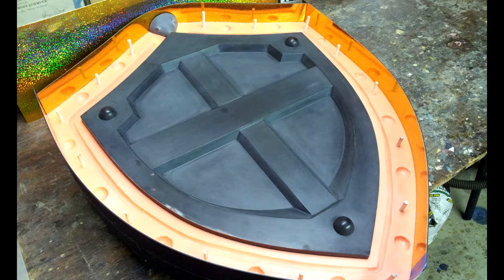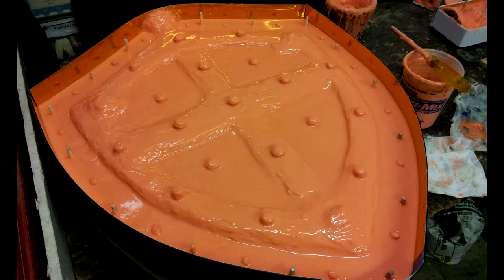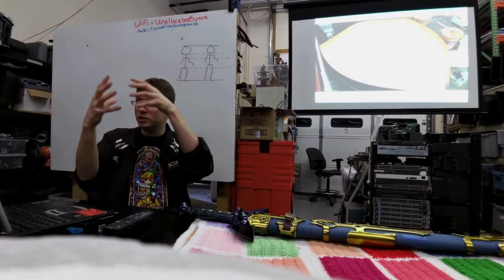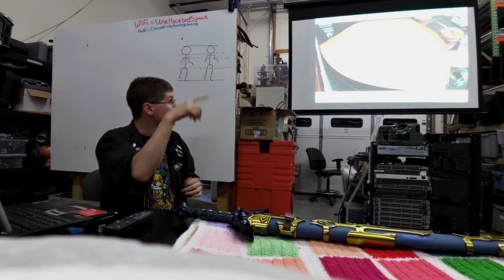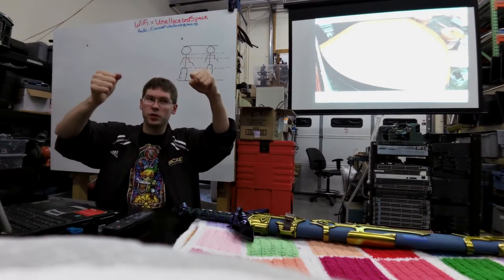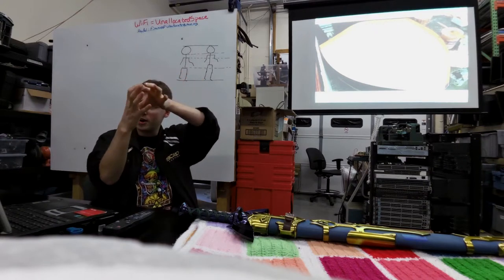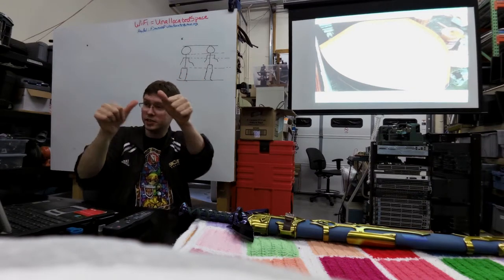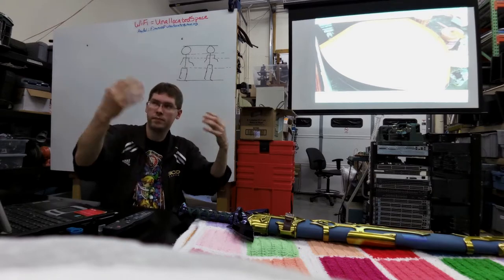This half now has dents where all those keys and running gaskets were, and the bolts or pegs are still sitting in there — I just split them off the other direction so I can pour more rubber and repeat the same process. I then put rubber keys in there — these are meant to keep the rubber aligned to the hard shell so the rubber doesn't slide around and misshape out of place. Especially for a shield with such a large surface area, if you lift the mold upside down it could flop out. So I made them like anchors with a little rim, clicking into place to hold the rubber into the sides of the mold during rotational casting.